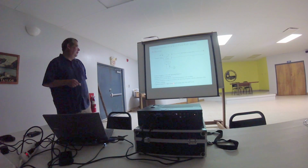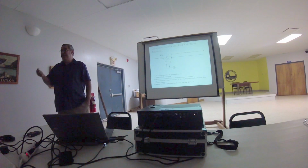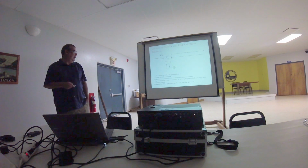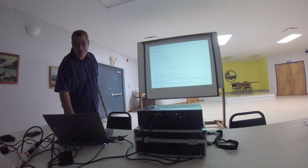And the capacitor is going to need to be a fairly high voltage capacitor if you're going to run more than QRP power levels. It's not as bad as what we've seen before as needing for a magnetic loop antenna, where a magnetic loop antenna at 100 watts needs a capacitor that's rated about 4.5 kilovolts or so. In this case, you need something that's around 600 volts. So it's a little easier to maybe source a cap that'll meet that range.